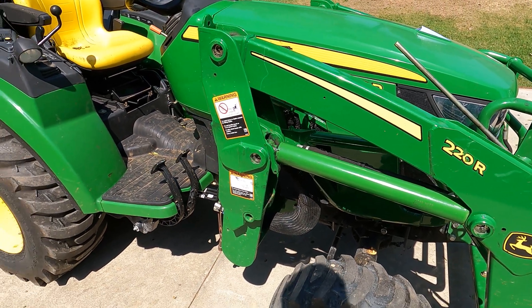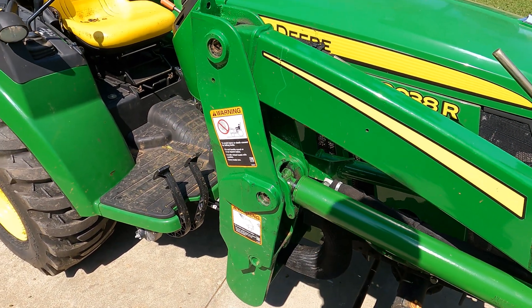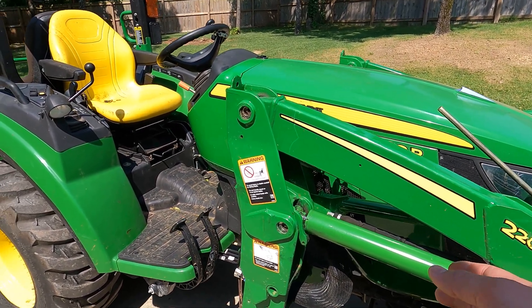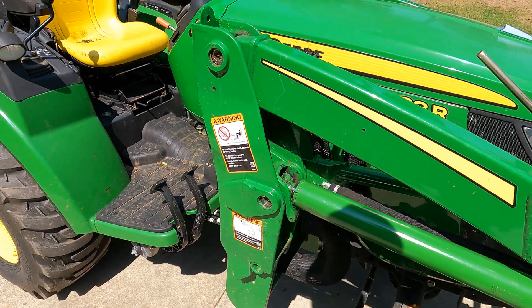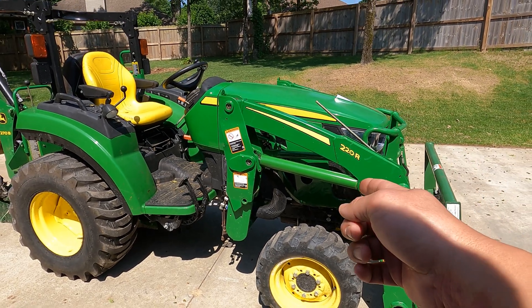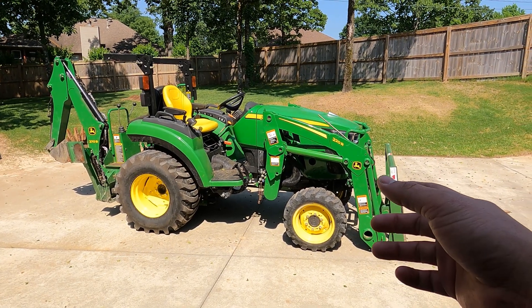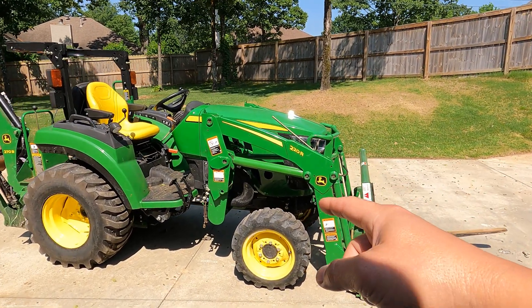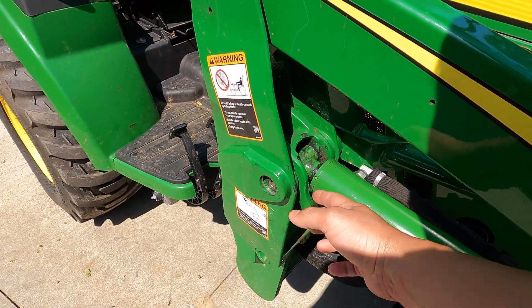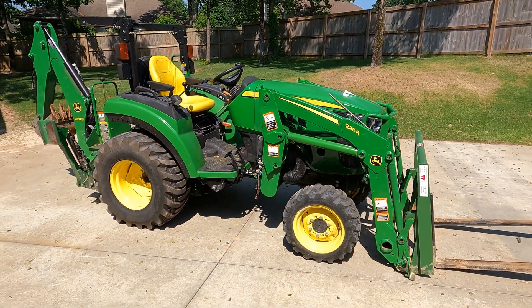You can see right there they're too wide for this quick connect. These will be the size you're going to see on the 3E, because the 3E does not have a quick-park loader. So the 1.75-inch is what's going to come on this tractor, but I had the two-inch and wanted to make sure they wouldn't work. They do work, but you can see there's a little bit of scraping on the edge of the cylinder — it's not optimal.